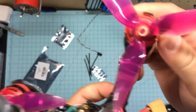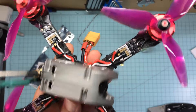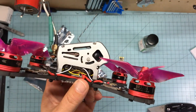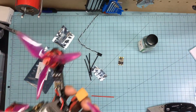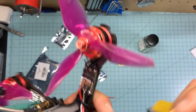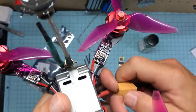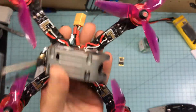I just do the tape underneath — very, very strong tape. Solder them up, clear coat them, done. This particular quad is a Kakute and the next one I'm putting them on is an Omnibus F3, but they synced up to BL-Heli S absolutely fine. I plugged them in, updated all the firmware, put my brake on stop. I did some basic test flights — my Star Wars theme, I know it's old, but I love it. And yeah, they fly fine so far.